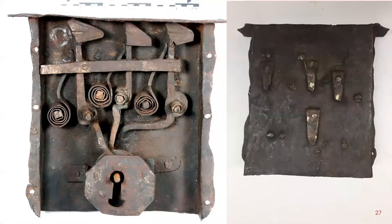This is three pivoting hooks all ganged together, but each one has its own lever that the key has to strike — it needs to avoid the wards and hit all three of these levers to open this lock. On the right you see the back side of the lock, and they've used the L-shaped mounting for the pin that the key goes around and for each of the pins on which the hooks pivot.